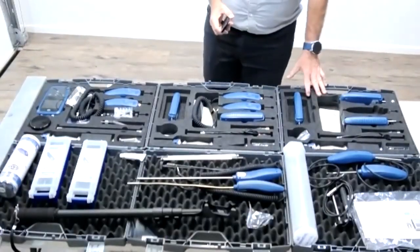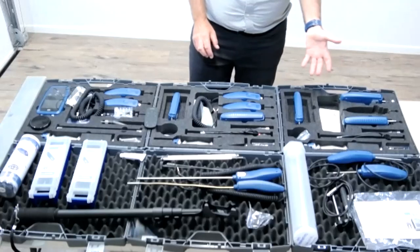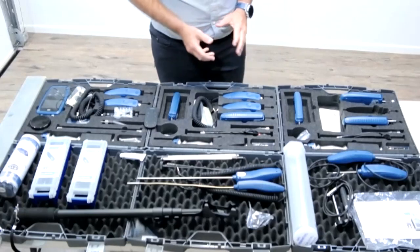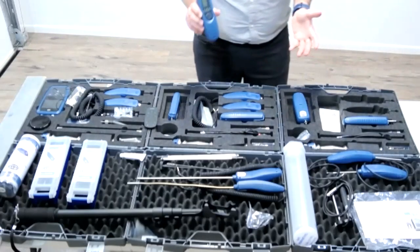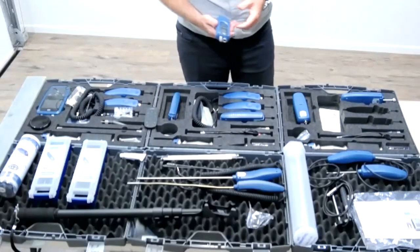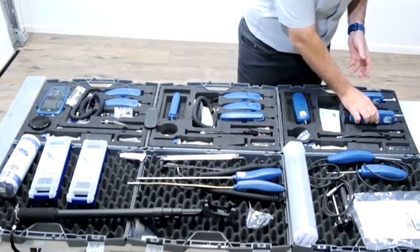So we're going to be showing you our 3-in-1 kit. We're going to be breaking this kit down and showing you the individual components of the kit, what accessories you can add to the kit, and what benefits the kit has. So this particular kit here has 3 meters. We have a timber meter. We have a non-invasive meter to do concrete and non-invasive settings where we don't have to penetrate. We have a grade hygrometer with a laser to check our surface temperatures.